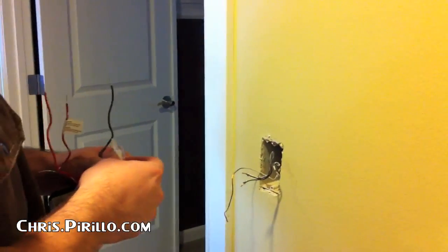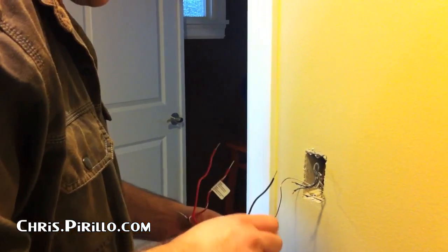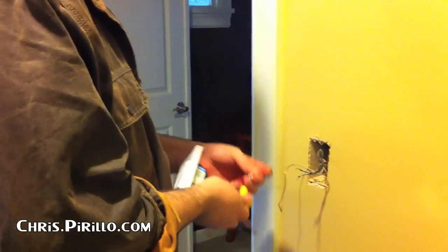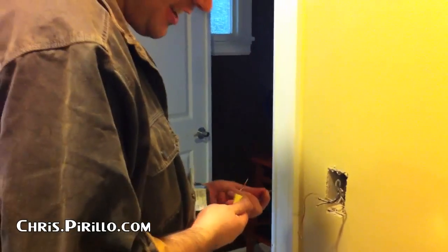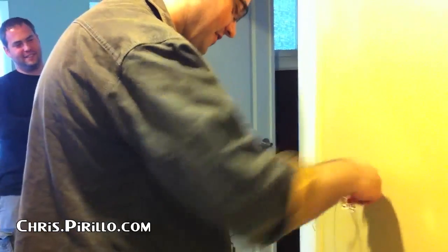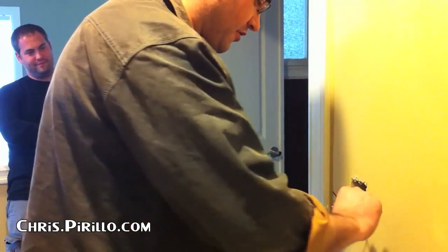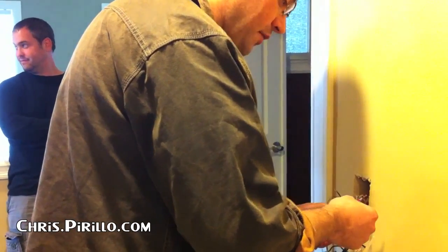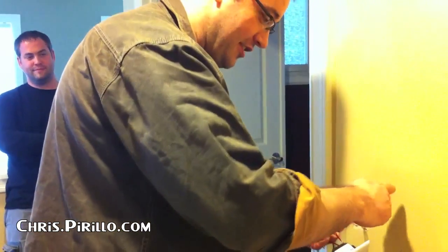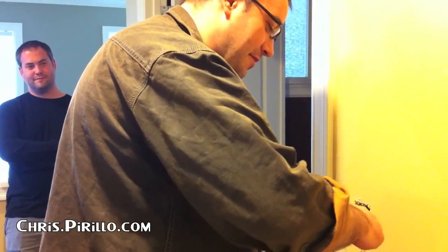Because your LED will run on like three watts. So when you run the dimmer all the way down, it'll just ignore it — you're like, oh, I got three watts of power, I'm happy. So we're not going to get shocked again because we don't have power? No, because I popped the breaker. Even when I have the power off I don't reach out and touch the bare metal. Some people would lick their fingers and then twist the two wires together — because if you're going to get zapped, you might as well have good conductivity.